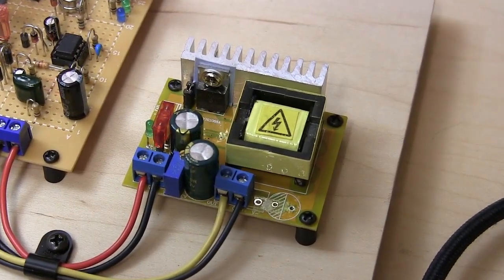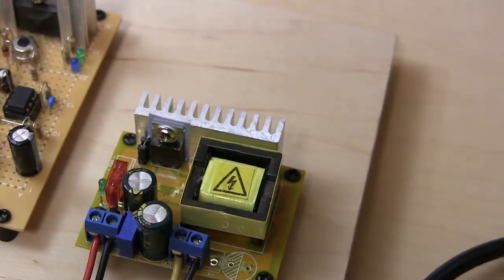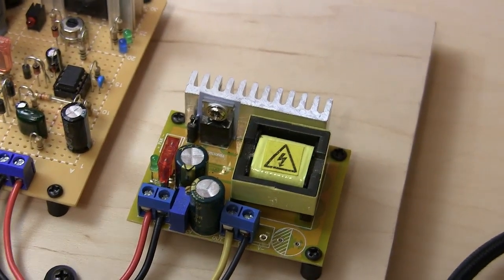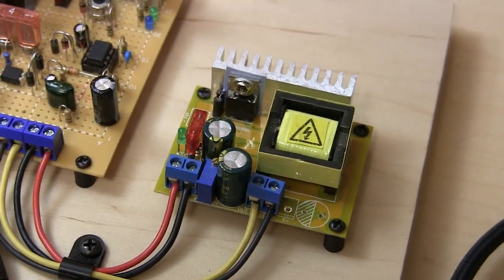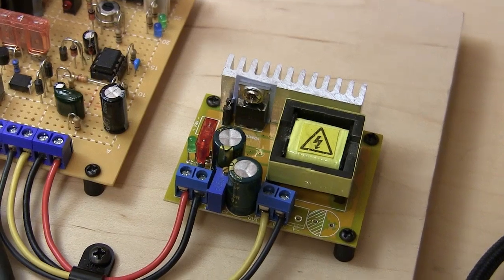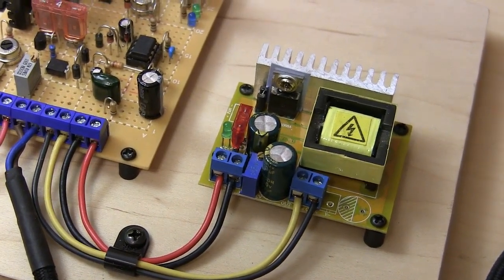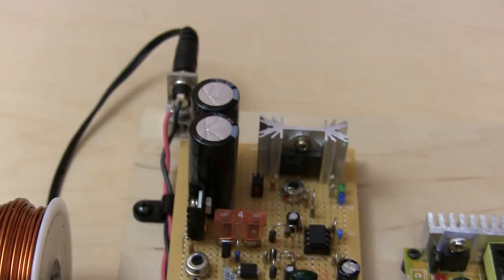The voltage generator right there is something I covered in my other videos. It's just a $10 high voltage generator from Hong Kong or China — a pre-made prefab high voltage transformer, a DC boost circuit. It just boosts 12 volts up to 400 volts. It's not a flyback transformer — it's just a regular pulsed transformer that runs at a very high frequency. If you load it down it will overheat, so you can't use it for charging a car battery or as a radiant charger. This is the only application you can really use that high voltage generator for, which is just charging an empty capacitor.